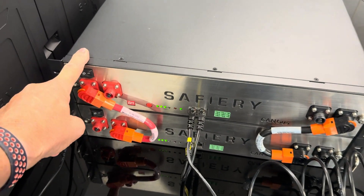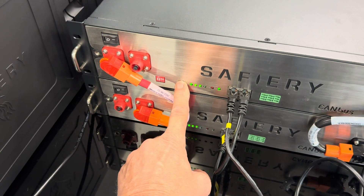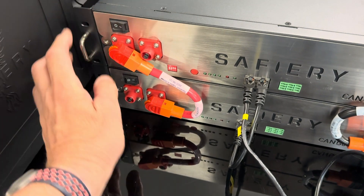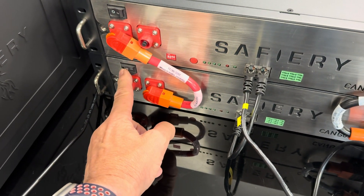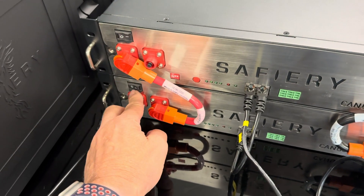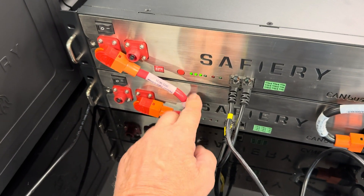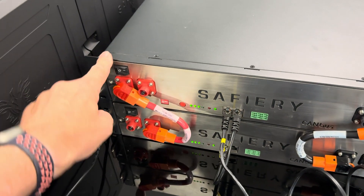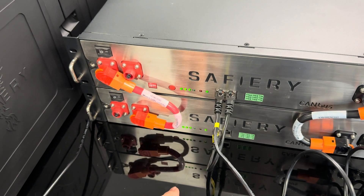On this battery, if you want to turn it off you've got to hit the BMS button first, wait for the green lights to turn off, and then turn that off. To start the battery up again you've got to turn that on, turn that on, hold that button in there, turn that one on, turn that one on. So if this is behind the fridge, that's extremely difficult to do.